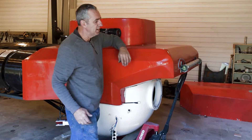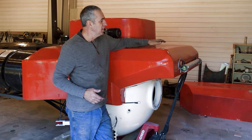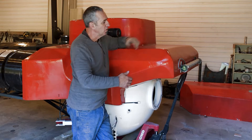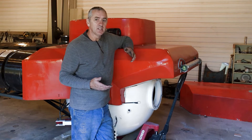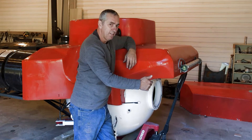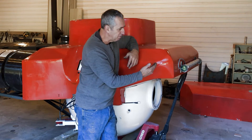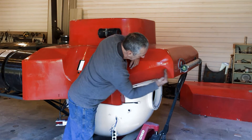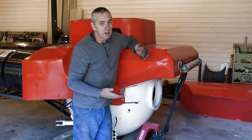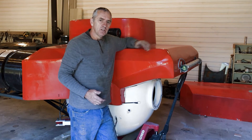Another thing I did — I wanted a little bit more ballast in the front. So this is the ballast tank for the front of the sub; it's integrated into the body. I wanted at least six gallons extra. The way I did that is I cut the front off and changed the angle. The front used to angle back, and simply by removing that and making it flat up and down in front — it doesn't look as good now, but I've got 60 pounds more buoyancy. So when it's at the surface, it gives me that additional stability.